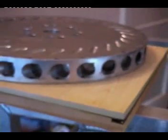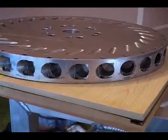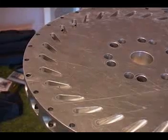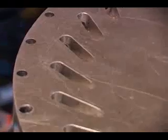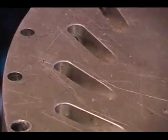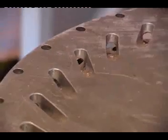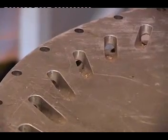In the center, on the outsides of the rotor, you'll notice slots. These slots allow us to remove magnets in the case of servicing, for example if a magnet is cracked or broken, etc. They allow easy removal of the magnets.